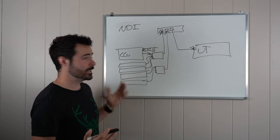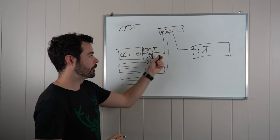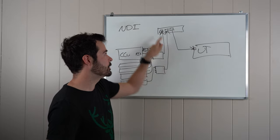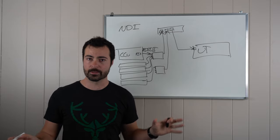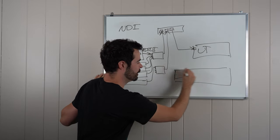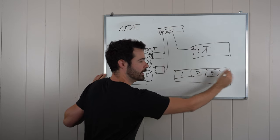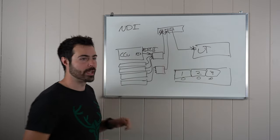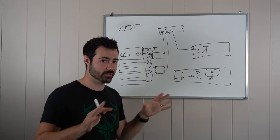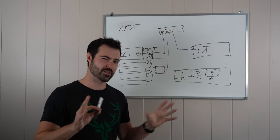So in summary: we're going to take the PIX outputs of the CCUs, run them into the BirdDog converters, get them on the network as NDI streams, and then set up our custom panel to subscribe to those independent NDI streams. We'll build a custom Dashboard panel on the UltraTouch that will have all five camera views. I'm also thinking we might have controls or tallies — I have some ideas. Let's start putting stuff together and making sure it's all going to do what I want it to do.